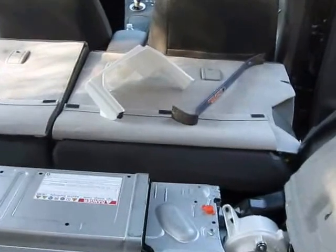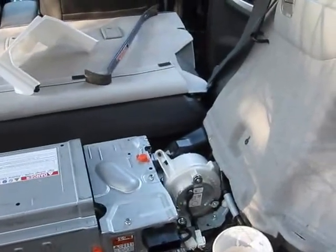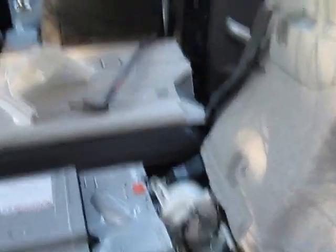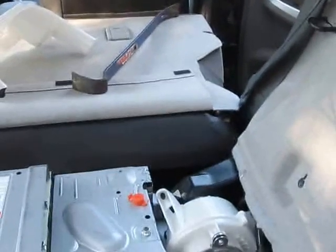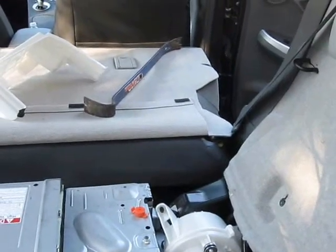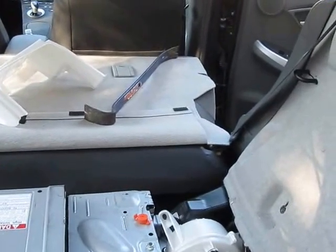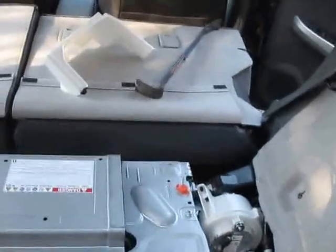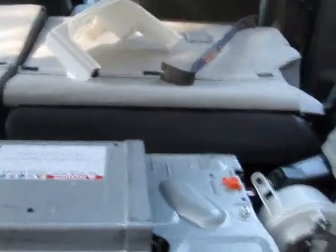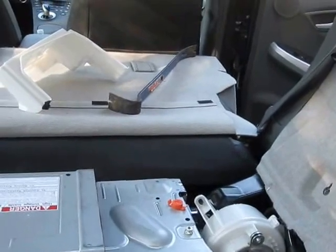The instructions say you've got to wait 10 minutes to make sure everything is off. However, instead of waiting the full 10 minutes I'm going to start undoing some of the nuts screwed on around the cover plate, which covers the transfer switch. I'll also get out my voltmeter to make sure everything is safe. The instruction booklet also says to take the connector you pulled out and stick it in your pocket so nobody can reinstall it while you're still working.